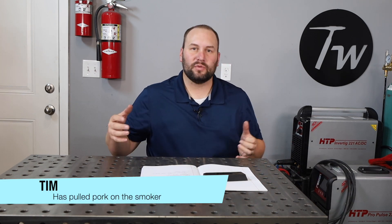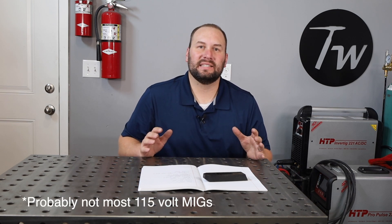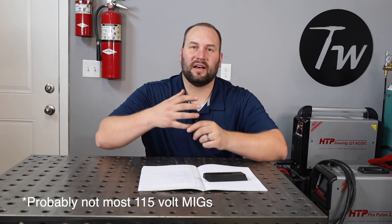Welcome to the shop. Today we're talking about some wire that can drop directly into most standard MIG welders and it really changes the game. It'll allow you to weld thicker material, reduce your spatter, give you a nice smooth weld bead, it's easier to run especially in the vertical position, and it can also give you better weld metal properties particularly under impact or shock loading you might see on equipment. It can also reduce the opportunity to have defects like lack of fusion that you can get with MIG welding on thicker material.